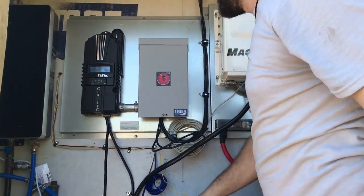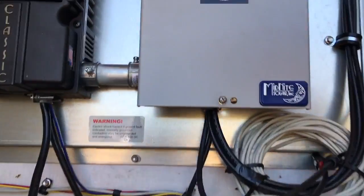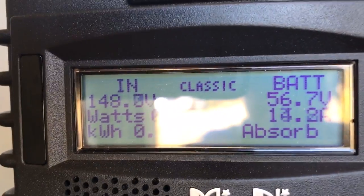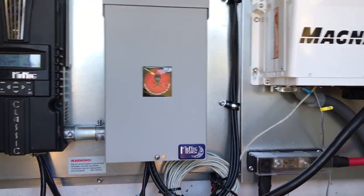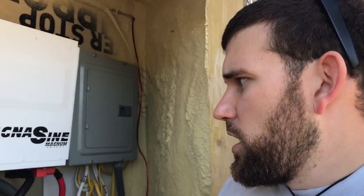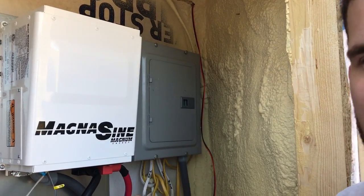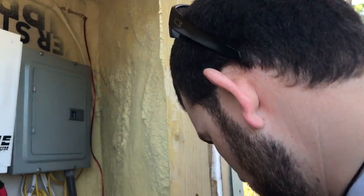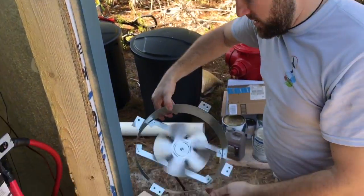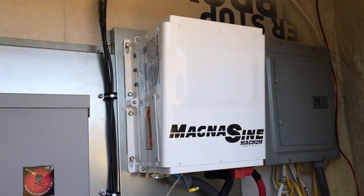We have the Midnight Classic 200 charge controller because we have this solar array in strings of five. You can check the standard solar array install on the i-card to see where we've done solar installs on a shed roof before — this is also a shed roof. The customer has 10 panels instead of the normal six that come with a standard package, and to be exactly accurate, there are 11 because one is a very small panel. The customer is putting a fan into the side of the house, and we installed the wiring and that solar panel for them today.